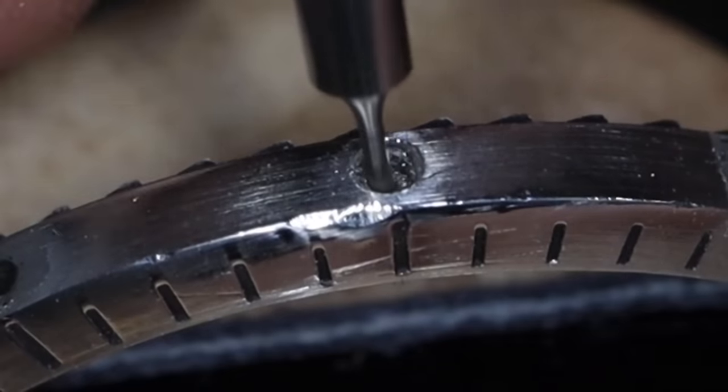And these posts are for the minute wheel, the intermediate calendar wheel, D5 on the cannon pinion for the hour wheel, and the date indicator driving wheel. Some 9010 on the hour counting wheel. Some D5 on the post for the hour counter lock and the hour hammer. And some D5 on the post for the hour hammer operating lever.